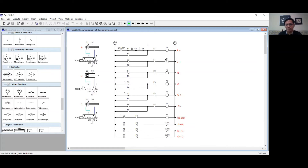When S2 is activated due to the extension of cylinder A, we activate F2, which is the extension of cylinder B. That activates S4, which activates B-, followed by A-, C+, and C-. When C- occurs, it activates F6. When F6 is activated and S5 is already activated due to the retracted position of cylinder C, we can reset the system after it has reached the final event in the sequence.